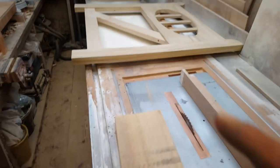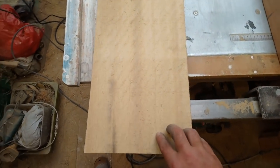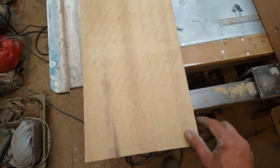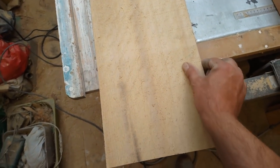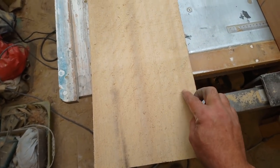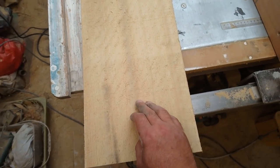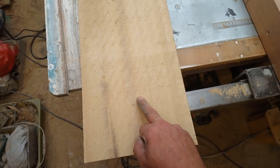Right, I've got to cut them battens. This is the same for any small dimension timber, 2x1 inch stuff, anything like that. What I'm going to do is cut this down to allow for three pieces. I need three at about 30mm square. So I'll cut this about 140mm, something like that. That'll give me enough for maybe 150mm. That'll give me enough for three pieces.